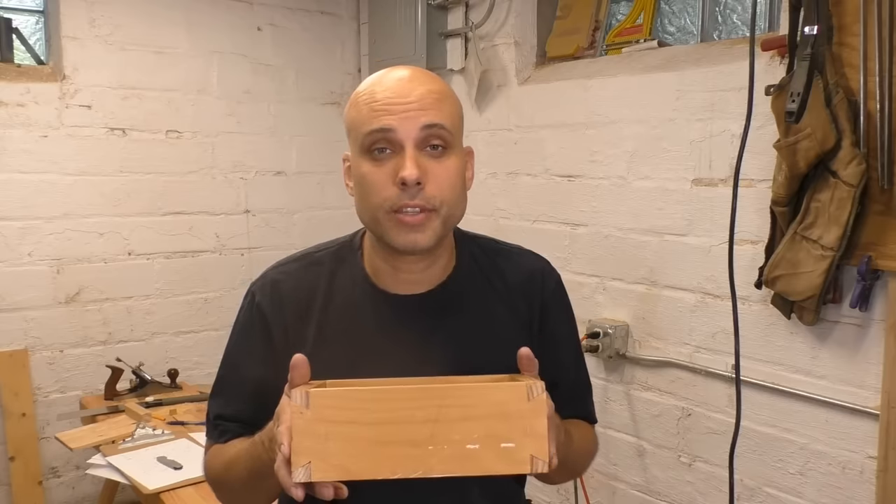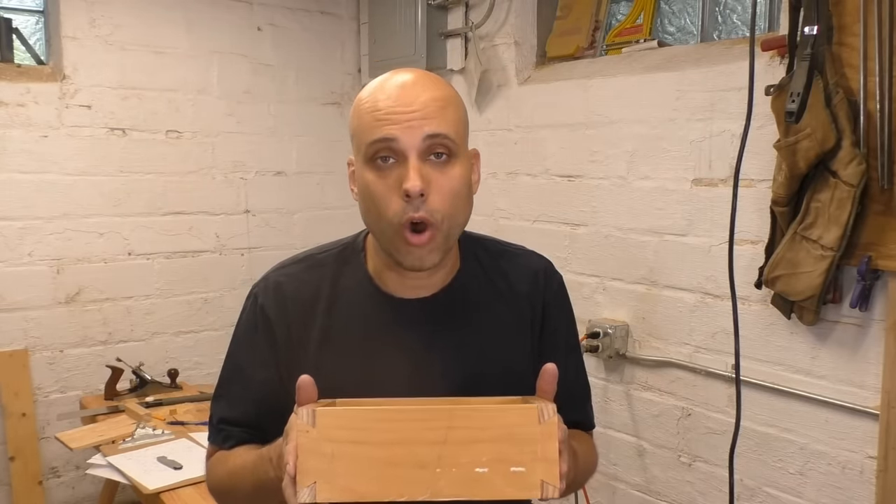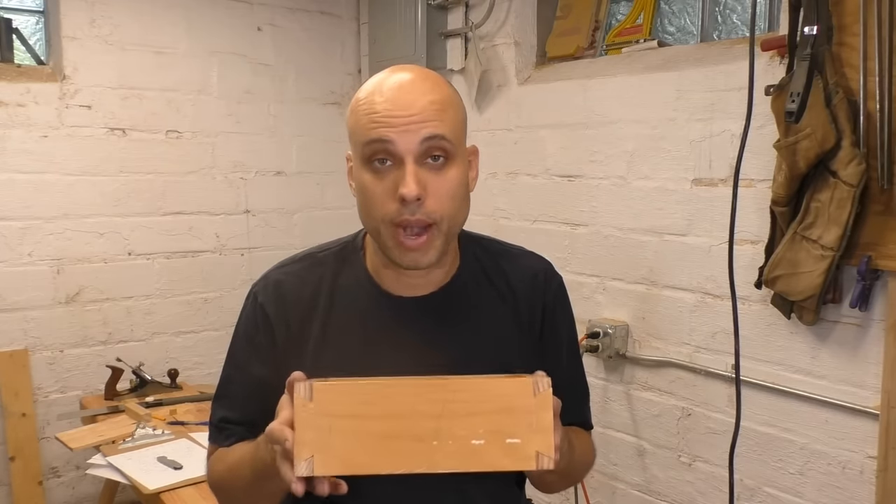Here is my assembled box, and I'll be honest, I'm pretty happy with it. Most of the joints look nice and pretty tight. Some of them are a little bit more gappy, but that's not a super big deal. I'm going to be assembling this with glue and clamps, and that's going to close up some of those gaps. I've got a bunch more tricks I can use to hide little mistakes and get a good finished product. Next week we're going to take this basic frame, clean it up, assemble it, add a top and bottom and hardware and a few other decorative details to turn this into a piece we can really be proud of.